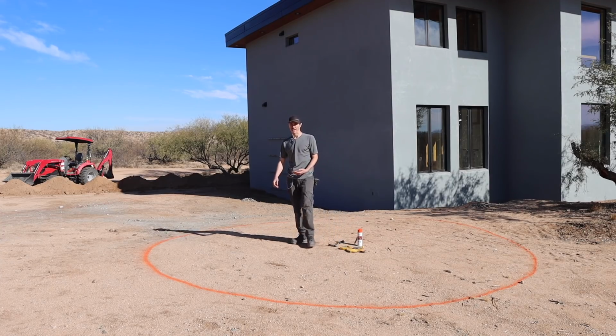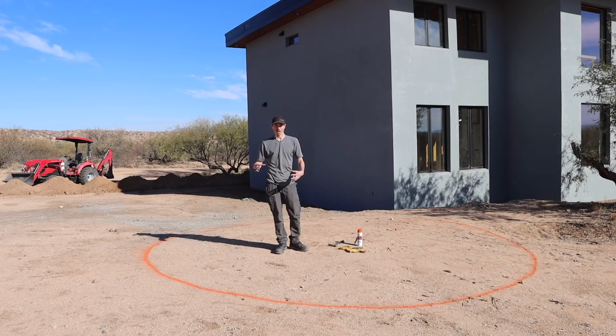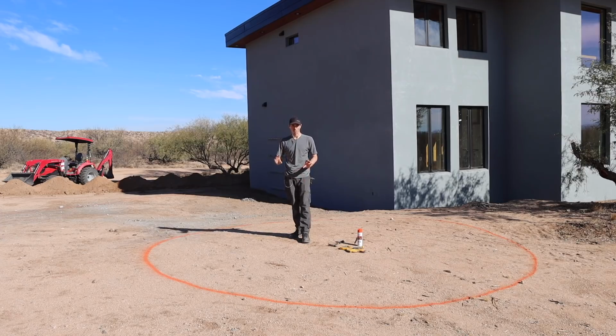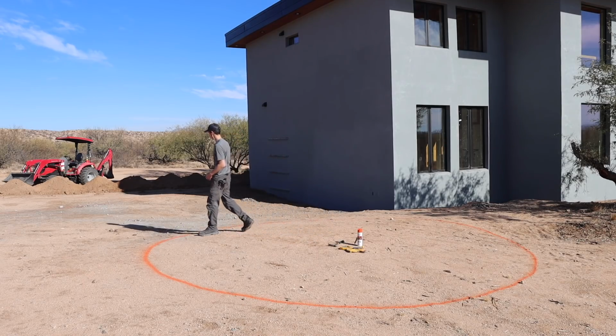Now with how these tanks are designed and how you install them, I can put the overflow on pretty well any side that I want. I can put the basket strainer for how the water gets into the tank anywhere around the roof that I want. And I can also cut in custom 2-inch fittings basically anywhere around the tank. The 12,000 gallon and above tanks come with 2 standard fittings, but it only comes on 1 panel. So you've got a drain valve, and then you've got your valve that you would draw water from. I can put that basically on any side of the tank that I want, but I can also cut in custom fittings if I want to as well.